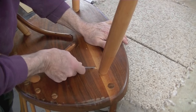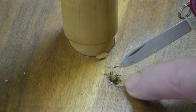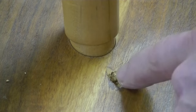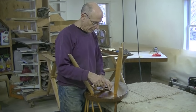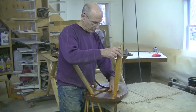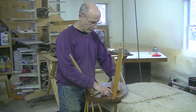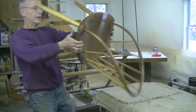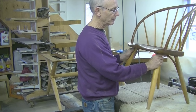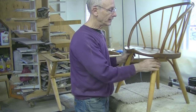Luckily that is a plug — actually, I think it's a dowel, not holding a small screw, but a dowel that goes into that leg. See how that dowel's moving right there? Looking at the way these legs are pinned, this pin — which looks like a 3/16th dowel — is moving with the leg. I began to realize if I try to push that leg through, I'm going to split all this wood out where it's so thin at the bottom of the chair. So I think what I want to try is a glue designed to penetrate joints and tighten them up without disassembling. I usually like to disassemble pieces, but if it's going to damage the chair, it's worth it to try the penetrating adhesive.